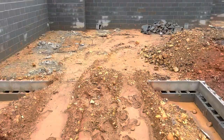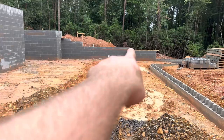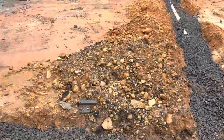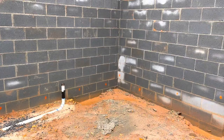But you'll notice this weekend, our plumber came and roughed in all our under slab plumbing. So we roughed in a bathroom over there in the basement. And then this pipe we stubbed up, that's gonna catch all the upstairs plumbing that's coming down the wall, right through there, into that pipe and out. And then we also roughed in a sink drain here so that we can put a kitchenette here if we ever decide to for a downstairs.